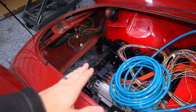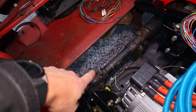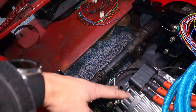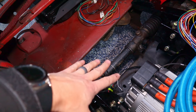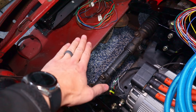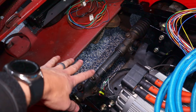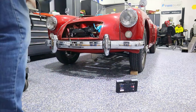Here in the front of the car you can see right through to the floor. I'd like to mount the pump at the lowest part. I also don't like the idea of road debris, water, or rocks being able to splash up on high voltage connectors. So I'm going to make a little tray or shelf that goes from the bottom frame piece up kind of to the bumper, to give me a place to mount the coolant pump and protect from road debris. I told myself I wasn't going to use cardboard templates anymore, so I'm going to get the 3D scanner out and design something that way.